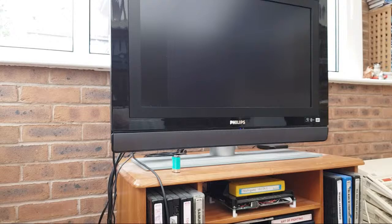You can see that's not booting now, I think. That should have booted by now. It's hard to believe, but a real-time clock is stopping this board from booting. And I'll perhaps show you on the schematics, there are some, I think, data bus connections there. But trust me, that's not booted. That's been long enough, hasn't it? That's been more than 30 seconds.